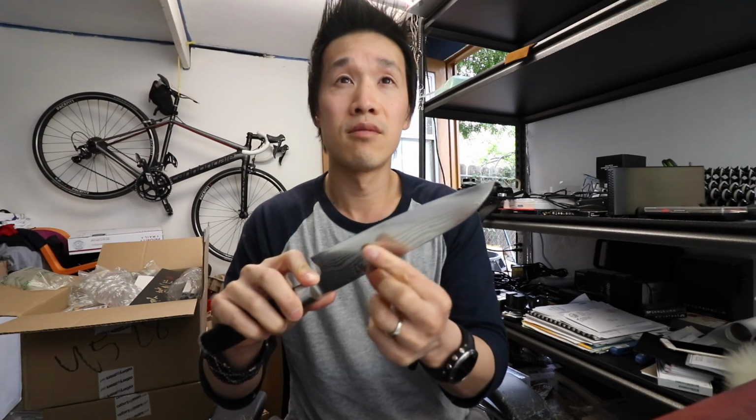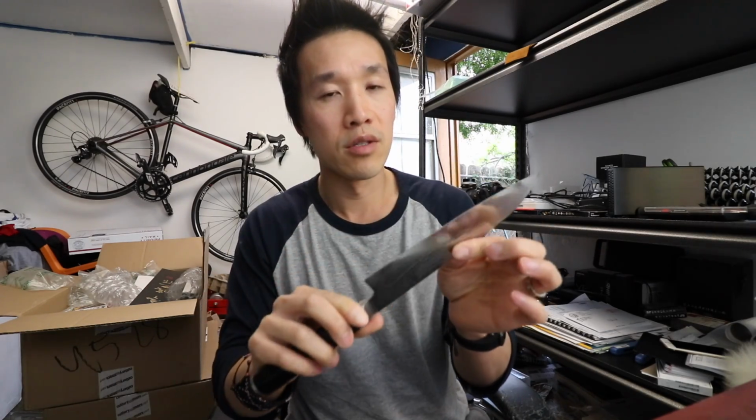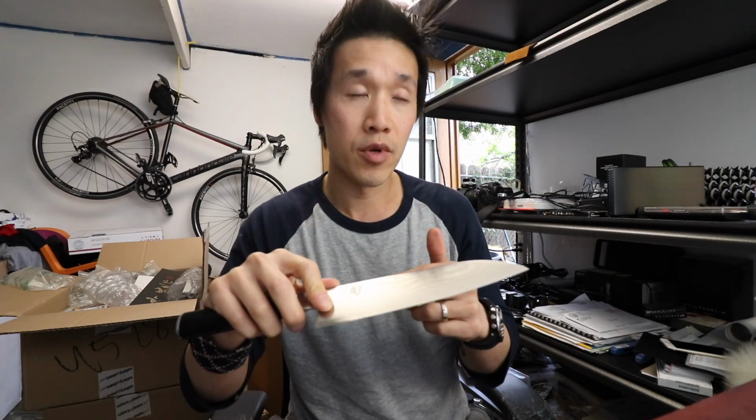So that's very common. If you're creating a lot of scratches on the bottom belly, within a half inch or inch of the cutting edge, your angle is way too low. Or what you're doing is flexing as you're sharpening. You're not keeping a very stable hand, and that's also very common with beginners, and even myself every once in a while. Definitely in the beginning, that was a problem. We tend to not be able to stabilize the knife very well.